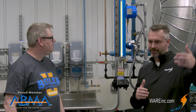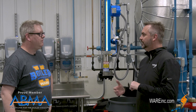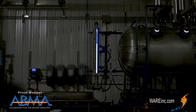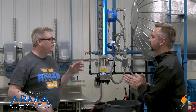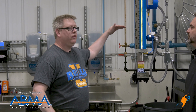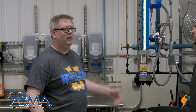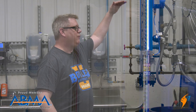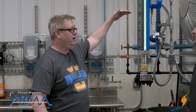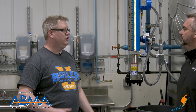In our starting shot, we were actually about 100 feet away. Now, we can talk about this high-vis sight glass. What is the importance of that and why would you need to have something where you can see it from far away? It's not unusual with a deaerator to have it installed up on a mezzanine or at the other end of the room. This level is important, and with the traditional sight glass you may have to get within a few feet to read the level. So if you could tell from ground level that you've got appropriate level in the deaerator, it saves you a trip up that ladder and helps you move on to the next step in troubleshooting or doing your checks.